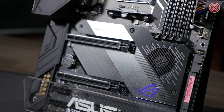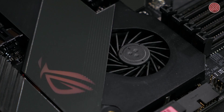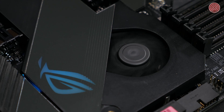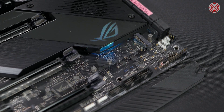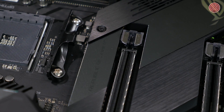With the increased power of the new Ryzen CPUs, there also comes a rise in heat. So to combat this, the Hero has plenty of built-in cooling features. We collaborated with Delta to create a custom SuperFlow chipset fan with a 60,000-plus hour lifespan, with specially designed air ducts to help generate more static pressure and focus air over the heatsink. The heatsink is designed with more fins for greater surface area to dissipate heat. The VRM heatsink connects to the I/O heatsink with an integrated heat pipe, increasing its overall mass and surface area. Dual M.2 heatsinks protect against throttling from excessive temperatures.